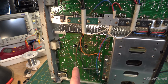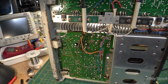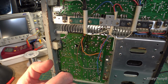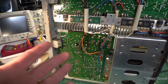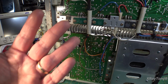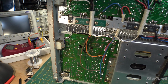The capacitors down in here, they actually put the vent for the capacitor on the bottom where the pins are. Should the capacitor fail and it vents, it'll vent its gases out. So what Carver is recommending is that you remove the capacitors and you shim them up with some nylon washers to give them room in case the capacitor should fail. They won't explode. They'll vent out the bottom.